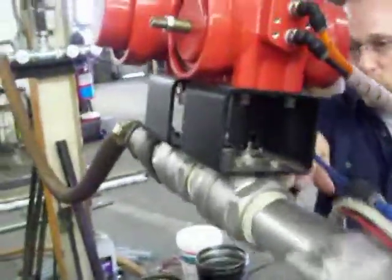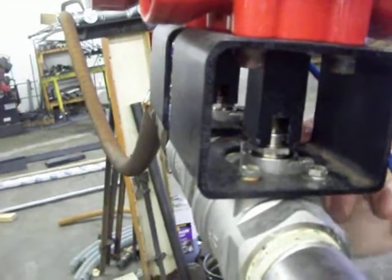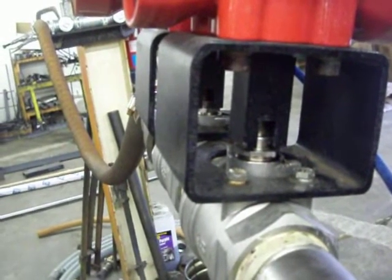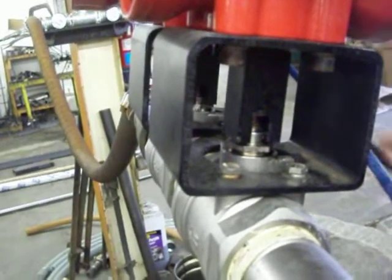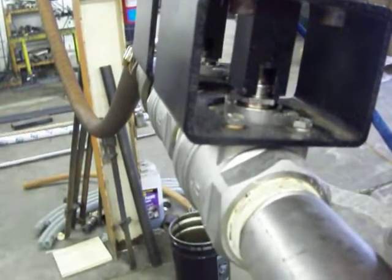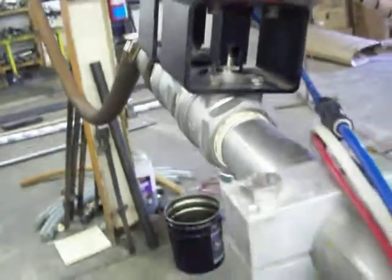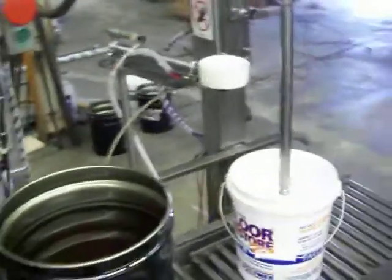Back here on the intake pipe you have two repacking or packable glands on your ball valves. If these start leaking you would tighten them down with a larger wrench — just tweak them tight and that will seal off any liquid. Since you guys are filling molasses, it's a pretty thick product so you probably won't have any issues, but if you do, just tighten them down a little bit at a time and that'll reseal the shaft.